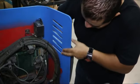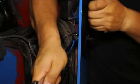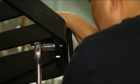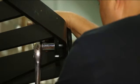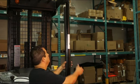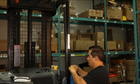Reposition the Backbone if necessary. Drill the two holes. Fasten the Backbone with the bolts and nuts provided. Tighten the bolt at the top, holding the Backbone against the overhead guard. The Backbone is held snugly against the guard by pressure alone. Do not drill into the overhead guard — this will weaken this important safety feature. Fasten the cushion pad with the straps provided. And that's it.